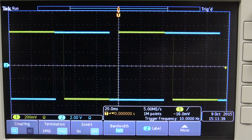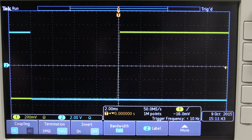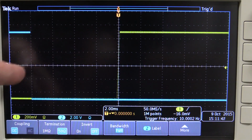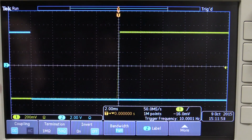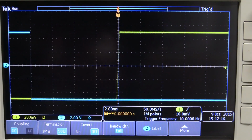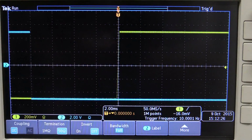I always love that. And eventually, if you sit there long enough and they're not both exactly 10 megahertz reference, I've done a video on this measuring clock drift, you'll actually see them slowly drift relative to each other. So if we wait long enough and they're not both exactly 10 megahertz oscillators inside that, well, they don't actually have to be 10 megahertz precisely, but they have to be exactly the same. Otherwise, if they're not exactly the same, you'll see them slowly start to drift.